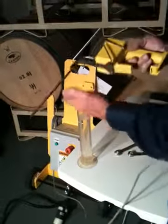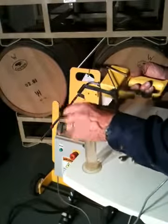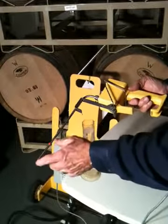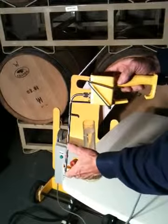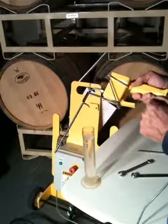It's set. And why would you want a longer tube? Well, if you're filling a Chardonnay barrel and you want to reduce the volume fill so you've got some vapor space on the top of the barrel, you can put in a longer sensor tube. If you want to raise the level, you can recalibrate up to as much as 4 inches from the tip. It's always measured from the bottom of the sensing tube vertically up. So we can go 0 to 4 inches approximately, or you can cut part of the tube off and raise the level again.